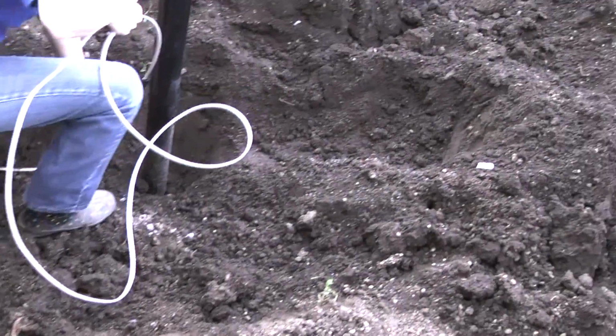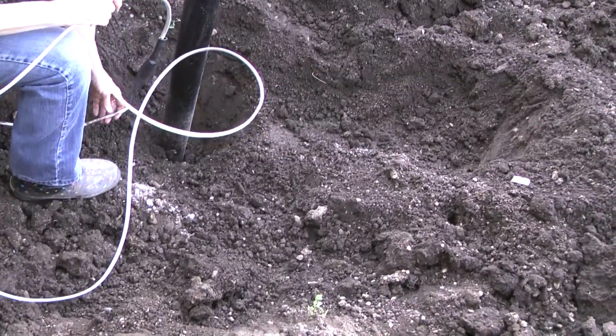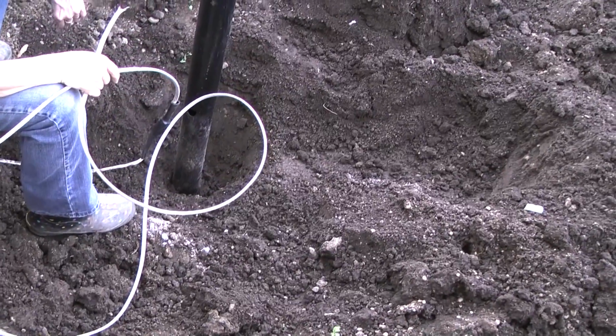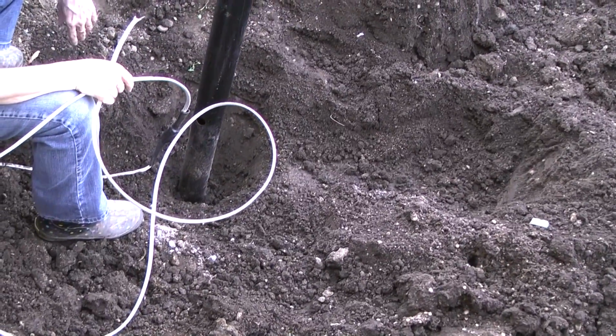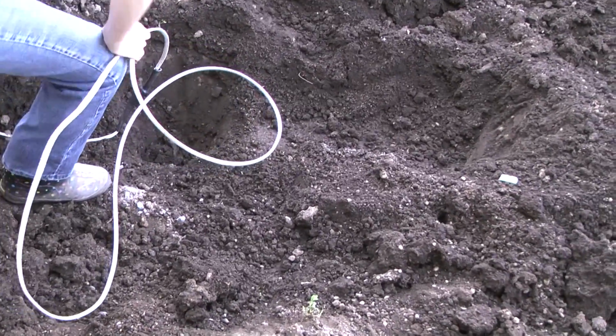We took that shrink wrap connector of those two wires that was supposed to be sealed tight around that number 14 wire. I was a little disappointed at how it was not sealed so well. But we took that cable, and instead of having to leave it outside exposed to the elements, we were able to feed it through the hole in the post. By feeding it through the hole in the post and aiming it upward, I felt like we were able to get it out of any situation where it might be exposed to the elements.